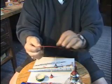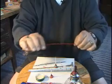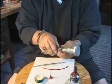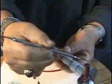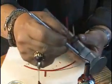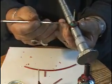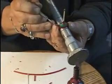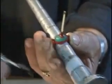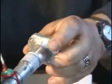We're going to work with this piece here, and I work it with my fingers, or I can run it over the alcohol lamp a little bit just to get it nice and flexible. So let's start. I'm just going to wrap the wax around the ring mandrel, and then attach the wax to, this is the band that I'm going to attach to the part of the design that's the base for the stone. Okay, so I usually start by just getting the band onto the design.